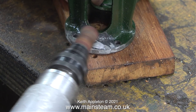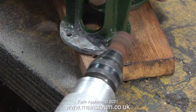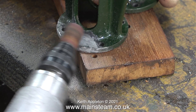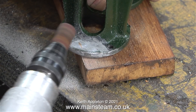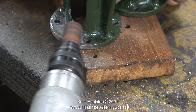This is the repair I made using JB Weld. I didn't just stick the part back in place — I ground away both surfaces of the damaged part and the standard itself, ending up with a clean metal surface to allow the JB Weld to stick securely. In this clip I'm using my Proxxon motor tool fitted with a very small drum sander to clean up the JB Weld.